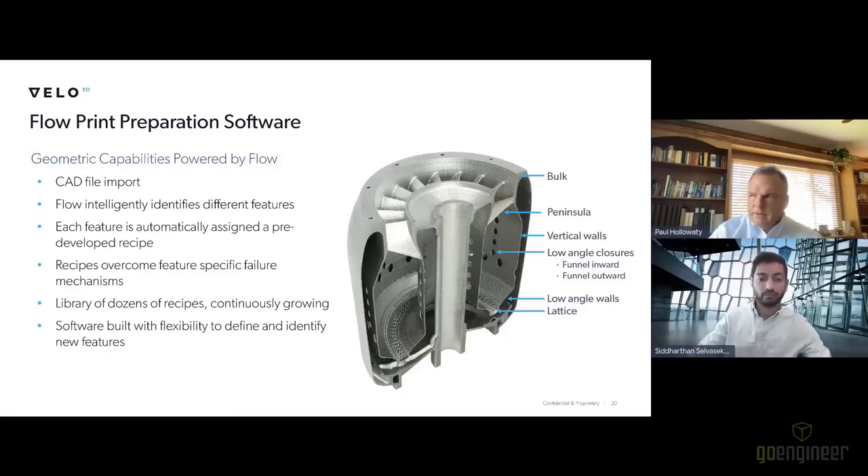This really gives us the ability — especially when talking about high pressure die cast tooling — to do large cooling channels. As the EV market grows, the need for larger die cast tooling is important. As tools get larger, the inserts get larger and the cooling channels have to be larger. We're looking for very circular cooling channels with very smooth up-skin and down-skin surfaces to provide long tool life and proper cooling. It's a very rough environment — one customer told me it's easier to put a part in space and bring it back down than to create a high pressure die cast tooling insert. You're going from 600 degrees C down to 60 degrees C in about a minute.